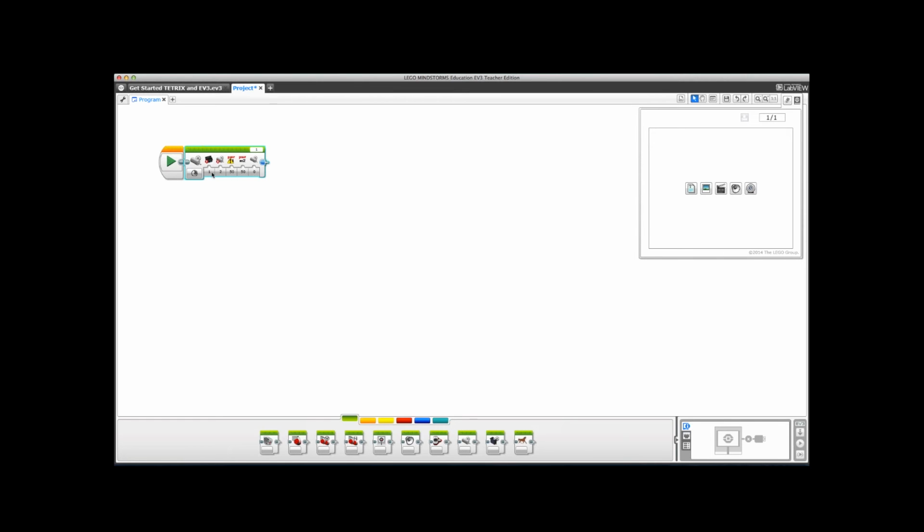Rotations is going to be very much the same. The only difference in that value is instead of degrees, you're going to tell it to go full rotations or 1.5 rotations, something along those lines. Again, that's a difference in resolution. If you're talking 1 full revolution or 360 degrees, you can see where the degree option is going to give you a little better resolution in your movement.